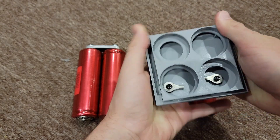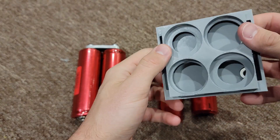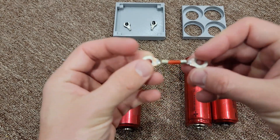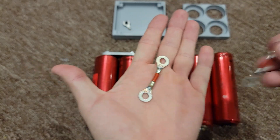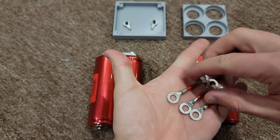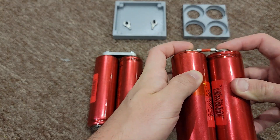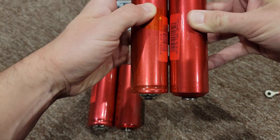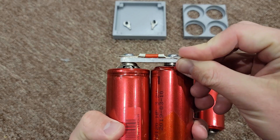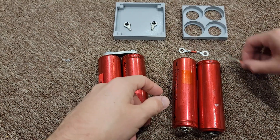Sure enough, just by moving these around using the template, there is plenty of space without needing to worry about interference between the battery and the box. After making all those checks, I soldered up ring terminals — I made three of them so I could put all four cells in series and make that 12-volt battery pack. Comparing it to the aluminum terminal plate, it is substantially thinner, and with the new screws, there'll be plenty of spacing in the battery box when all cells are assembled.